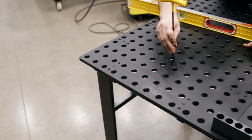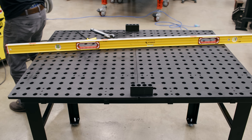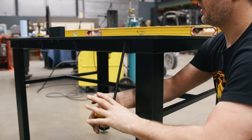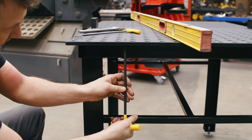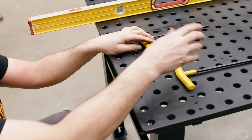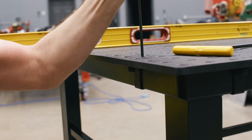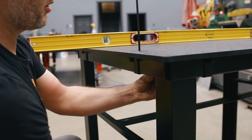Go back over one more time and make sure everything's touching, because as you adjust one screw the others lift up. Make sure they're all touching the frame underneath. Double check that the plate is straight and the blocks go from hole to hole, and now we can come back with our 5/16 hex and snug up the straps. They just need to be lightly snugged up — they don't need to be ridiculous. Don't use an impact, don't use a drill — just lightly hand-torque each of these. If you start to see the foot deflecting on the strap, stop. Go all the way around the table.